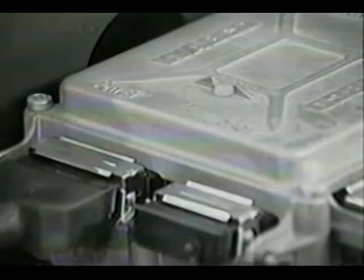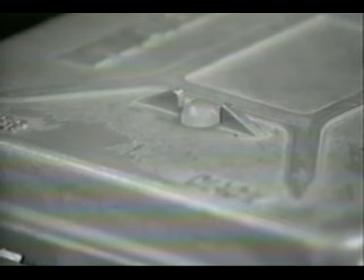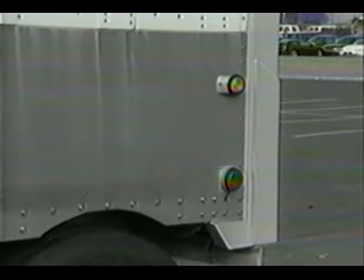The ECU detects electrical faults within the Easy Stop ABS. When a fault occurs, the ECU stores a fault code in memory, then signals a malfunction by turning on the warning lamp. All trailers built after March 1, 1998 are required to have the warning lamp on the left side of the trailer, near the rearmost pair of axles.